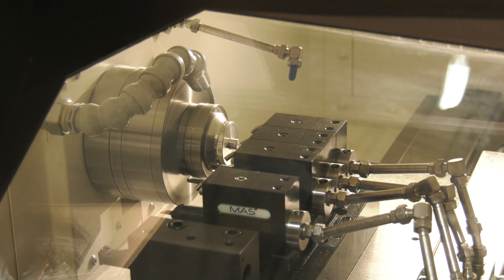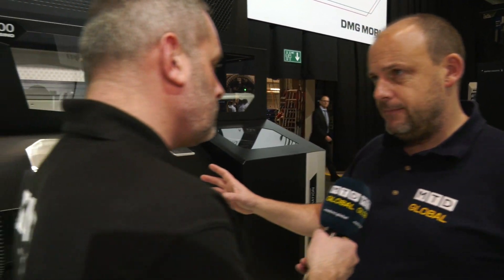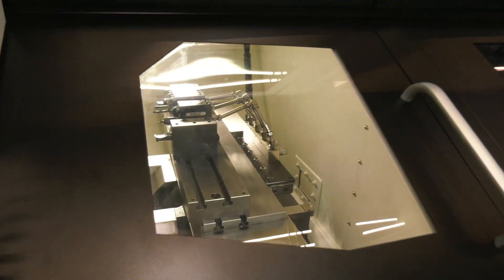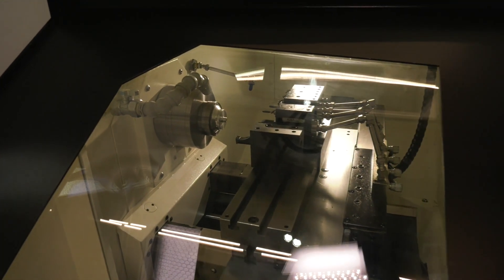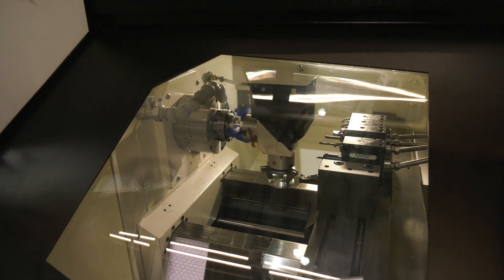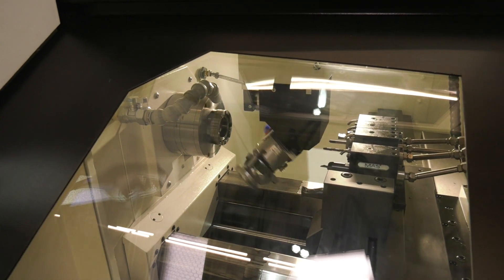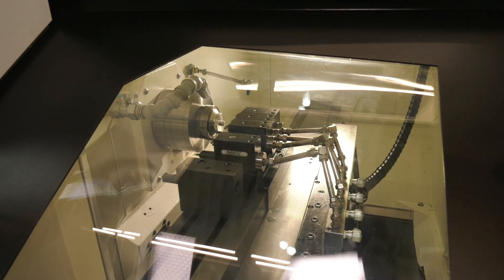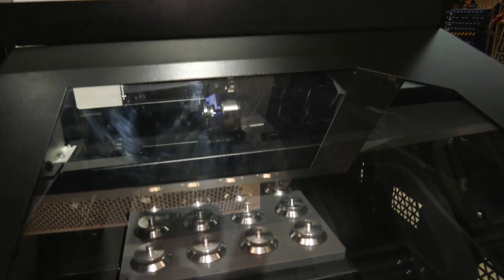Well, this is about productivity. It is a three-axis machine, a turning machine, with a 38mm bar diameter and 100mm max turning diameter, so it's quite a small machine, but extremely, extremely quick, as you've seen. Now when you say quick, turning and making money is all about actually turning that round very quickly for customers, and I see an array of products — some parts in there — they're quite soft materials. Is that where this sort of machine is aimed at, really?